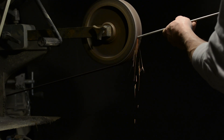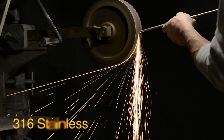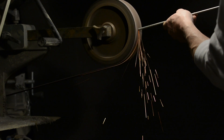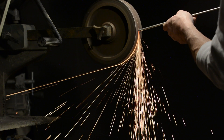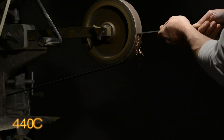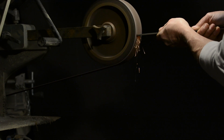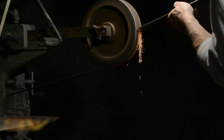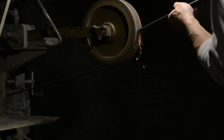So now we're turning to the bad stuff — the steels you want to stay away from. This first steel is 316 stainless. None of those little dandelion sparklers. 316 is in a general category called austenitic stainless steels, which includes 303, 304, and a whole bunch of other steels, and those steels are not capable of being hardened. Now, some stainless steels are suitable for knife making — 440C is the classic cutlery stainless, and here are a slew of other ones. But these are good steels with a problem: they all heat treat very differently, and if you don't know one from the next, you're wasting your time.